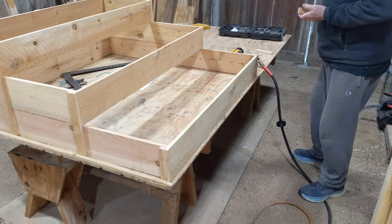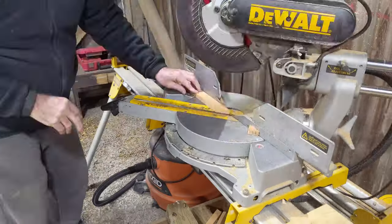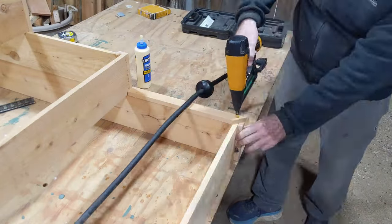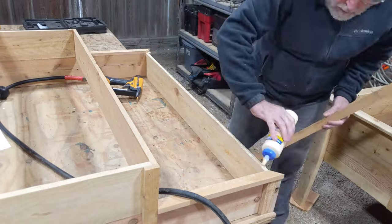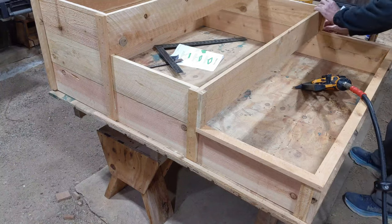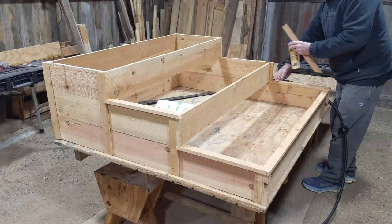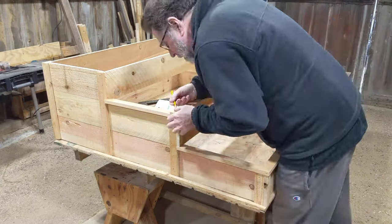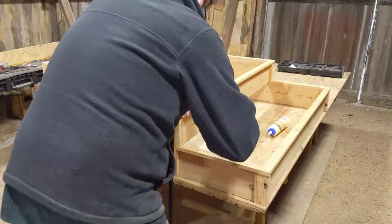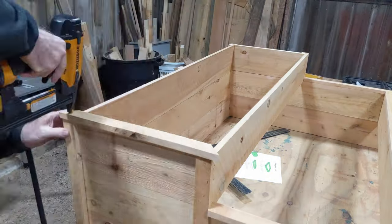Steps seven, eight, and nine involve installing the riser and tread trim for the first two tiers. The riser trim is essentially square blocks fastened to the face of the tread. The tread pieces are mitered for aesthetics — they could be butt jointed as well, but a little low-key carpentry flex using the miters. I think they look better. When marking your trim pieces to cut the miter, use the inside corner of the box to show the short point of the miter. I also put a staple through the edge to help connect the miters and glued all the miter joints. Steps 10 and 11 detail installing the last riser trim and top tier tread trim.